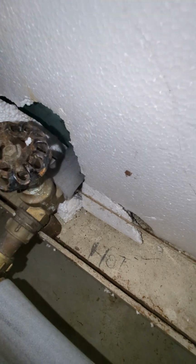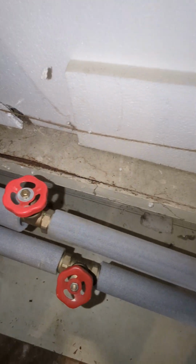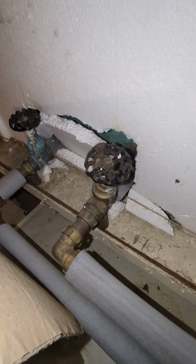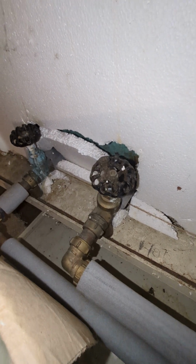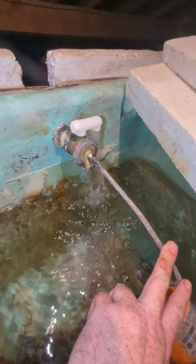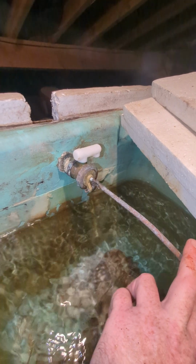So when you run a hot tap, water will flow from your hot water cylinder downstairs, and then the hot water cylinder will be refilled by the water stored in this tank, and then the ballcock will drop and allow water to flow, and then once the tank is filled, the ballcock will stop. And you can see now the ballcock has stopped in this tank. I've left plenty of room for expansion.